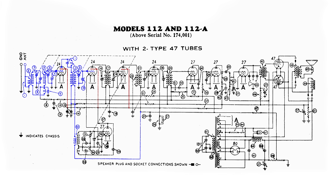It's an interesting circuit the way they've got this set up. If you take a look at the cathode of the 24 and the 27, they are connected together and they share a capacitor and a resistor to ground. The 27 is the oscillator, and this connection of the cathodes together is how the oscillator signal is applied to the 24. So now we've got the oscillator signal on the cathode and the RF on the grid of that second 24 tube. They get mixed together and we have an IF frequency of 175 kHz.